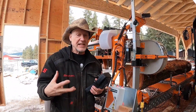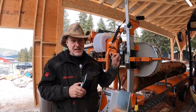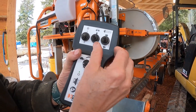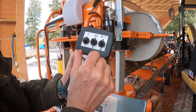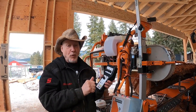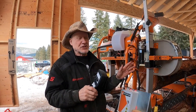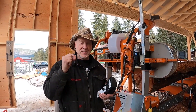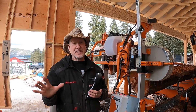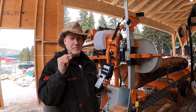The previous corded controller and circuit board — I don't know what aspect of that combination it was — but I would go to make an incremental adjustment, my definition being something less than an eighth of an inch. So if you're familiar with this controller, this raises and lowers the saw head. And I would just bump this, just do a little tap like that, and guaranteed it would jump a full eighth of an inch. So now we're playing a game of hit and miss. I would end up with boards that I wanted to be precisely one inch, and some would be one inch and some would be one and a sixteenth. This one takes it slower, steadier, and I can hit the mark every time. Big win.